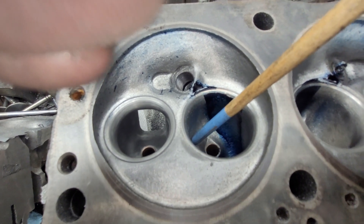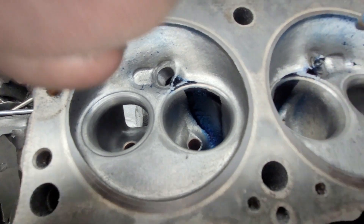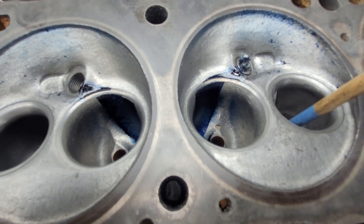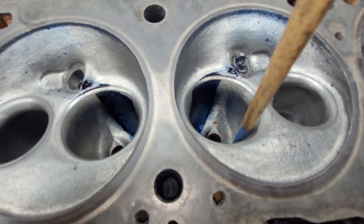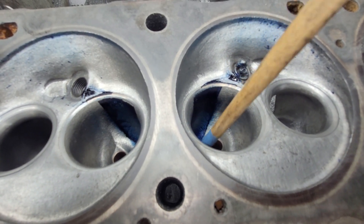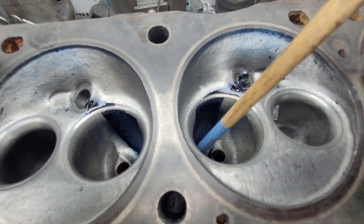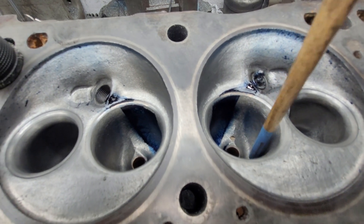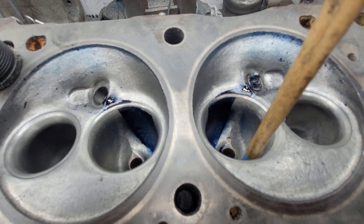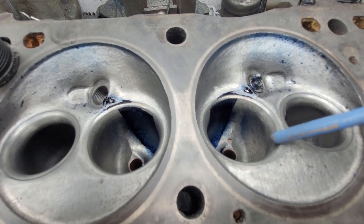The problem is this wall is adjacent to that wall and there's water between them — if you make this wall too thin there's a cracking issue, so we don't want to do that. But in a case where you have core shift, there was plenty of metal on one side and not that much on the other. You can push it thin on that side, but still you don't want to push it past a certain limit.